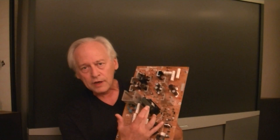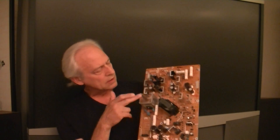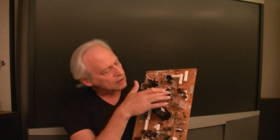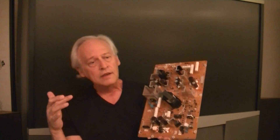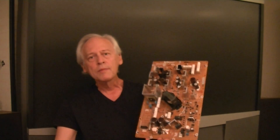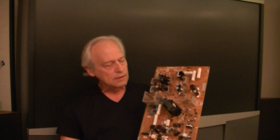So I want to show you something. This is one of the boards in question. Notice the big power transformer, the huge heat sink, and the other heat sinks throughout the board, along with raised power resistors — big resistors raised way off the board for ventilation purposes. This board produces lots and lots of heat, and that's why we have this issue of expansion and contraction that eventually forms a cold solder joint.